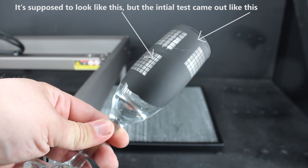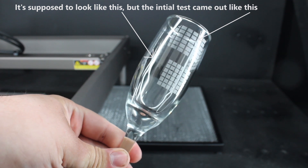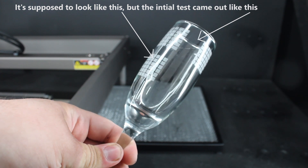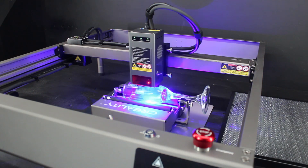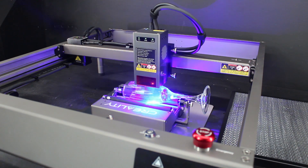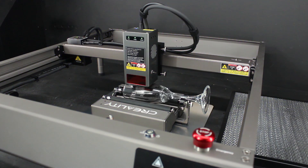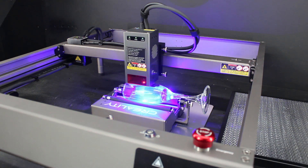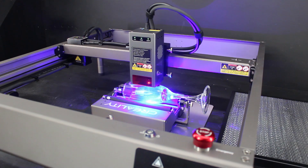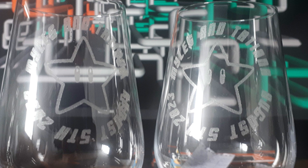I calibrated this out by designing a host of squares and printing it on a test piece of glass. The math came out to having to reduce the width to 75% of its original size to get it all properly working. Also, because of my cabling issues and not having a laptop present, having to manually press the stop switch during the initial homing process was also required. After a few runs, I got the rhythm of it pretty good and it was no longer an issue. This last part isn't a fault of the machine in any way — it's super recommended that you tether it to your computer to do the rotary tool; I'm just outlining a quick workaround. Anyway, with all that figured out, it actually produced some nice results, and I was able to engrave some wine glasses for a relative of mine at her wedding.